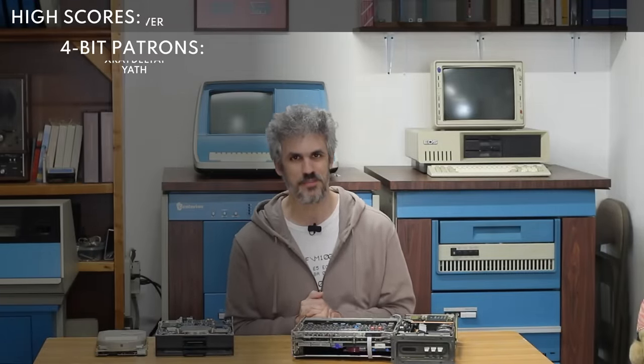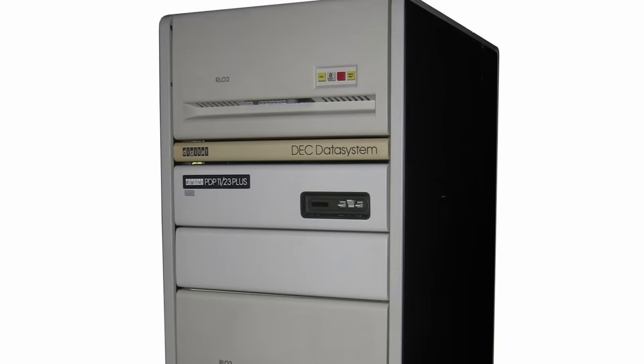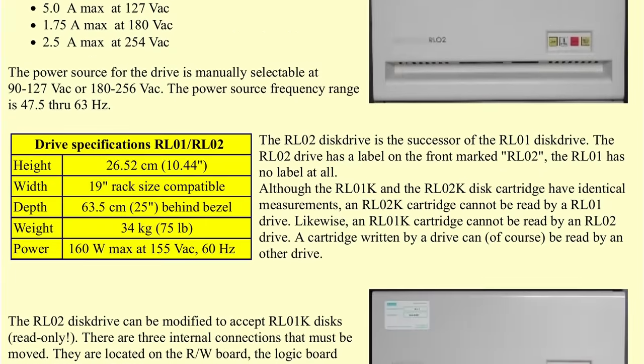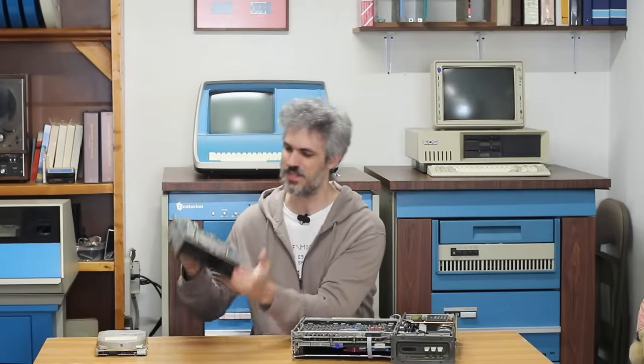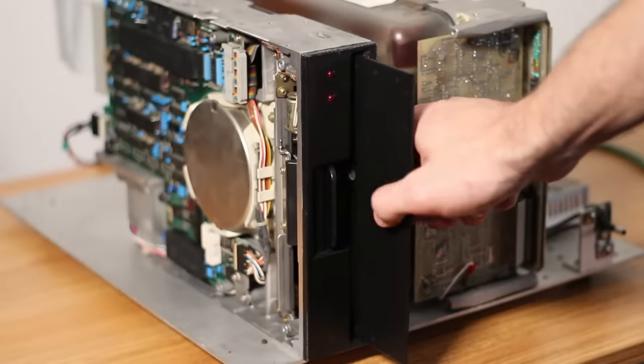Initially, the 1123 or 1103 or any of those were meant to be used with big boys like the RL01 and RL02. These are like 14-inch hard drives weighing well over 100 pounds, and that's just not gonna work for a portable system. So instead, I'm gonna try and get something like this 8-inch NEC half-height floppy drive working,